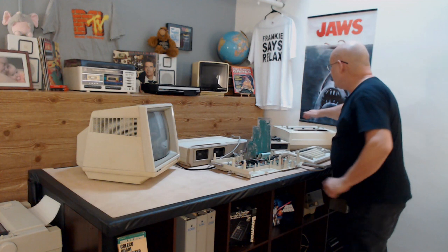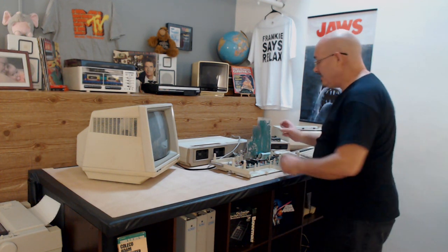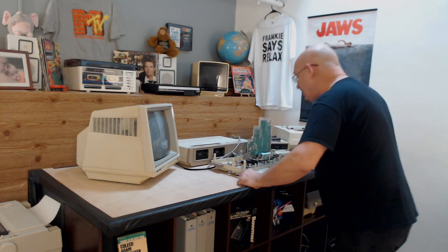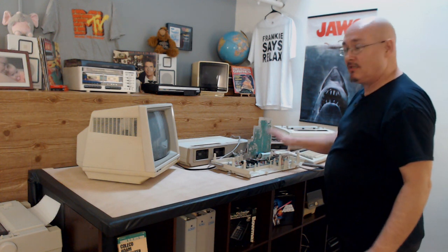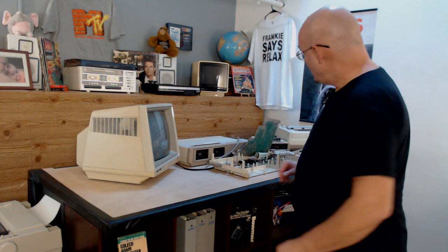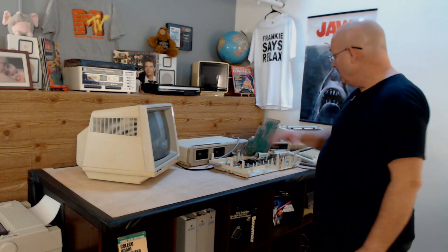Let me try something else. Again, he replaced the chips in here. So it makes me wonder if maybe the chips may be bad. So what I'm gonna do is I'll go off camera for a second. I'm gonna pop these chips out. I'm gonna put chips in from a different board and see what we get. Okay, so what I just did is I just spent some time swapping out each ROM chip with the one from the other board, testing, see if it worked.